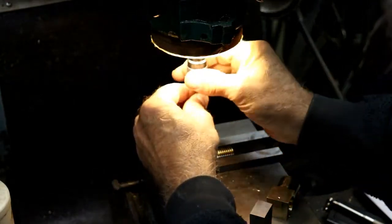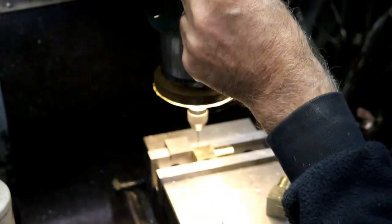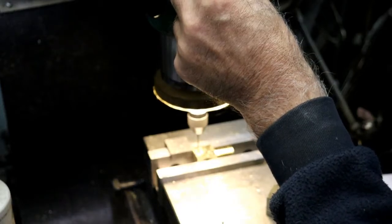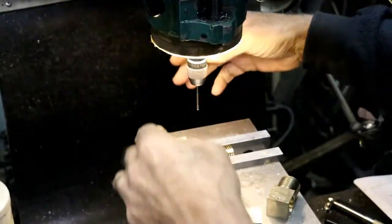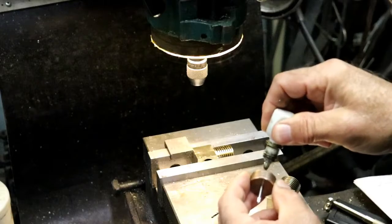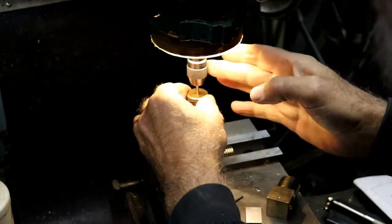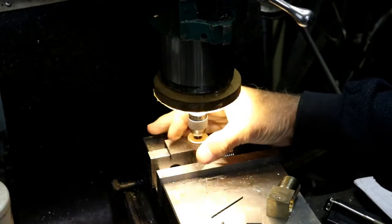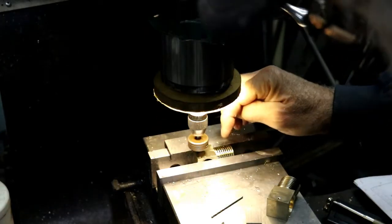Drill all the way up there. Grab the block, don't forget the block, put it in, stop. Little drop of Molly D. That's about all it amounts to, is one drop. Drill chuck, lightly clamp, and tap the hole. Now, after this one, we're going to move 335 on the other side, over here.